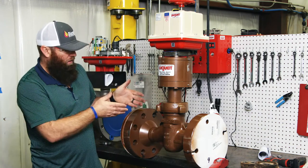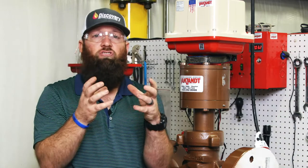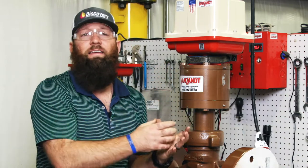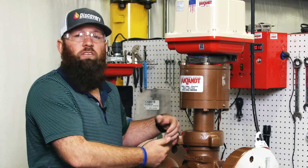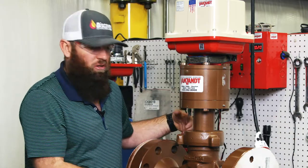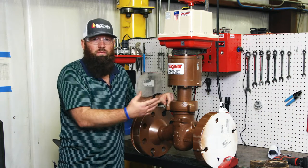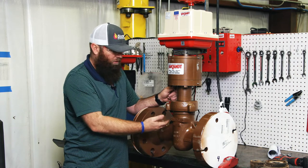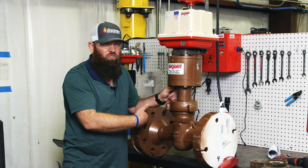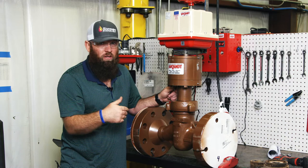This valve is a cage-and-sleeve design with tungsten carbide in the center cavity. It's called an impingement choke. When your water comes into the valve, it actually splits the stream inside the valve and your pressure drop is created by impinging on itself inside the cavity — so you don't have to worry about a wear sleeve or anything downstream washing out or cavitation. It has the best pressure recovery of really any valve on the market, so all pressure drop happens inside the cavity with no piping issues, washouts, or pinholes.